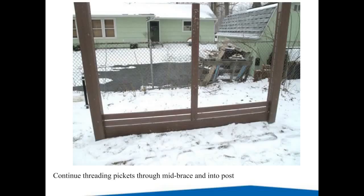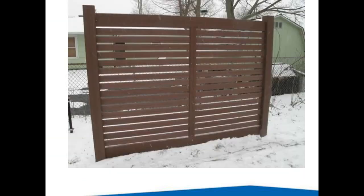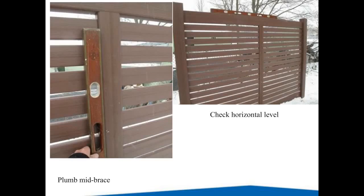Flex that in, then work your way up. Throw in your lock rings on your top rail and then put that in. Always use your mid rail hardware kit — whether that's a vertical mid rail like on the Breezewood or a horizontal mid rail like on the Imperial or Princeton — because they keep everything looking the way it's designed to look.